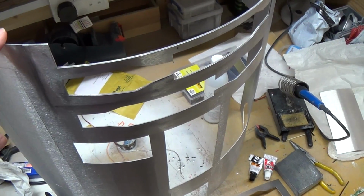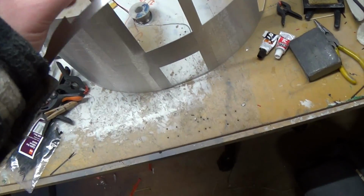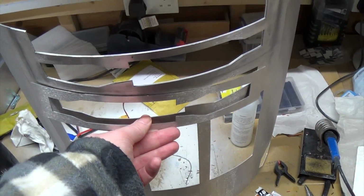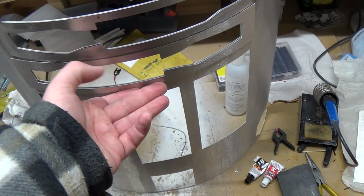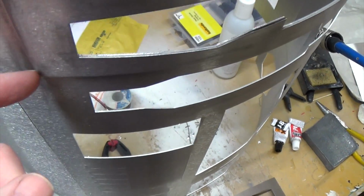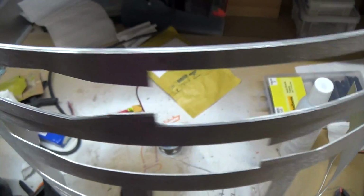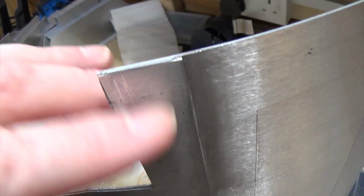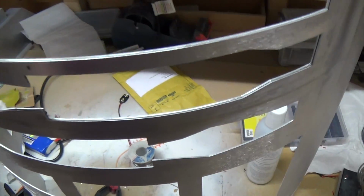So this is the inner front, and what you do is you actually cut up the outer front, it would appear. That's the first time I've done it. And you fit them like so to create the raised areas. I've already done one yesterday, and you can just see here, it needs a bit of rubbing down and tidying up, but this is where I've put the first one on and tried to match it as close as possible with the existing detail, so you get a sort of double skin around here, which will tidy up later on.